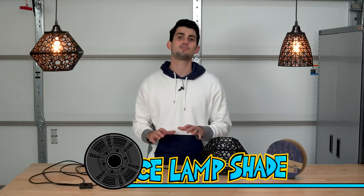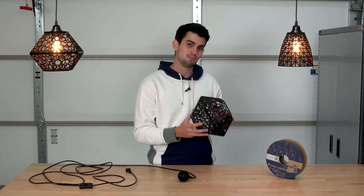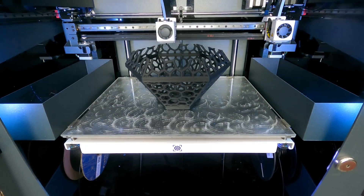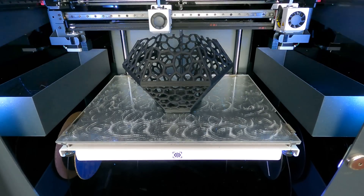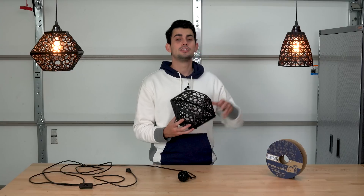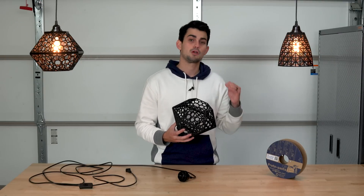Admittedly, the third model is a little bit more aesthetic than per se useful, but I love to incorporate lattices in my models and I could not resist showing off these different lampshades that I've made. The larger hexagonal shade requires a 300x300mm build area and is no problem for the massive BCN3D Epsilon. The shade is designed to be printed without support material, so PLA or other materials that bridge well are a must. The smaller cylindrical shade can be printed on a 200x200mm build area, which is perfect if you have an Ender-3 size build plate. The shades are designed for E26/E27 sockets, which is what most lamps use.